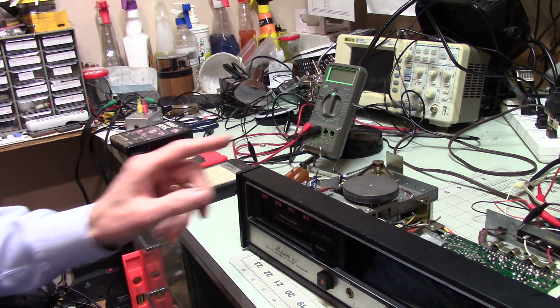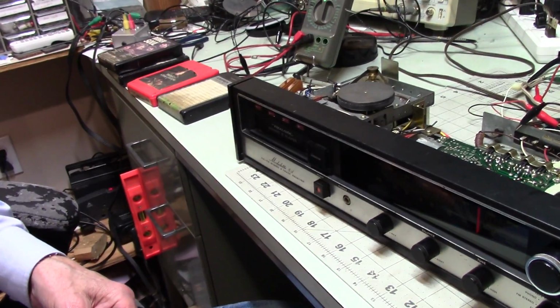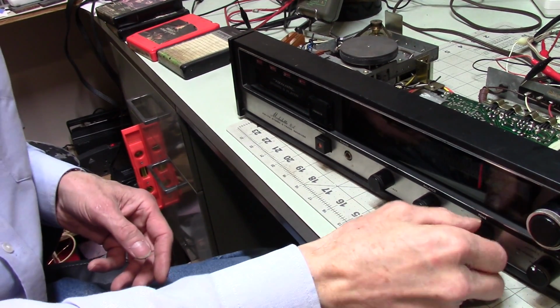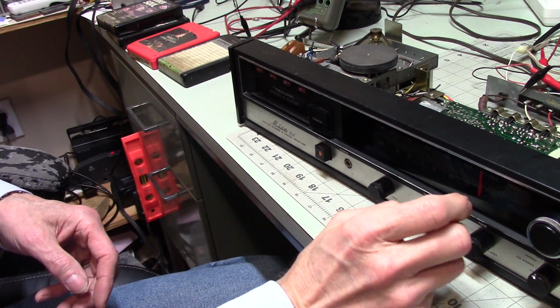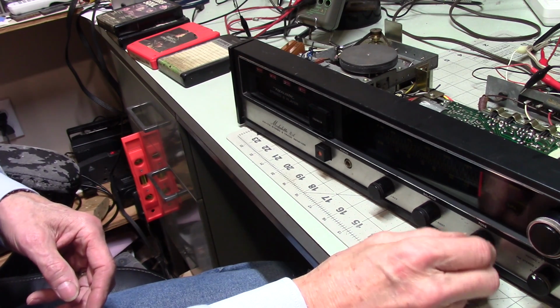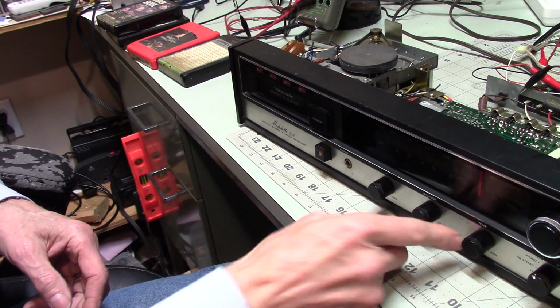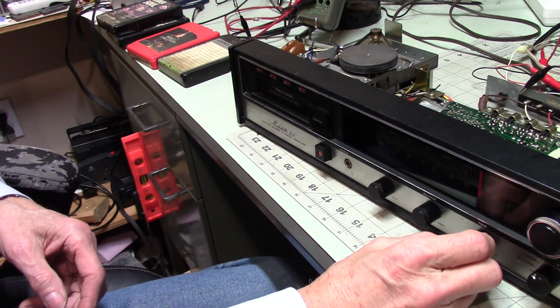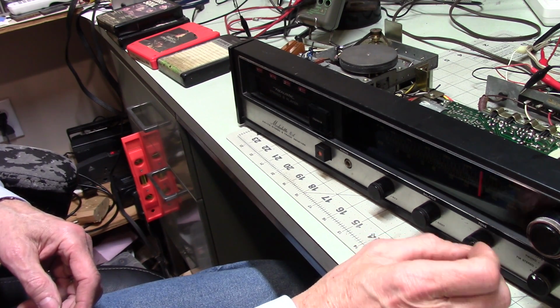I'm really truly surprised by this, because it does have a decent sound. It's cheap. Your tone control on this, if you look at this, it is just this one tone control. And when you're using the tone control, all you're really doing is killing the high frequencies. When you crank it back to the so-called low tone, you really don't enhance the bass at all. All you're doing is trimming back the treble.